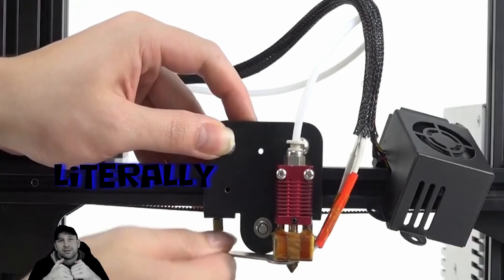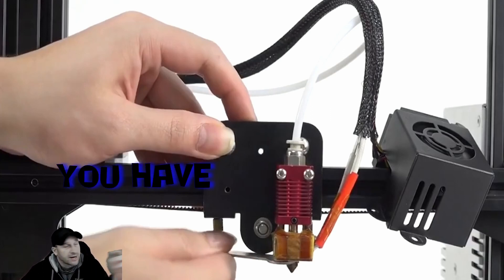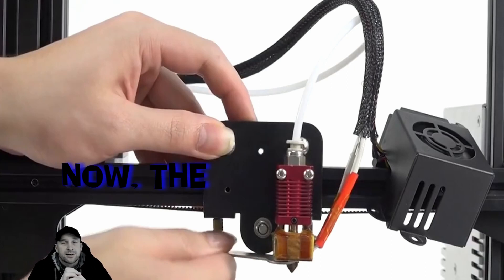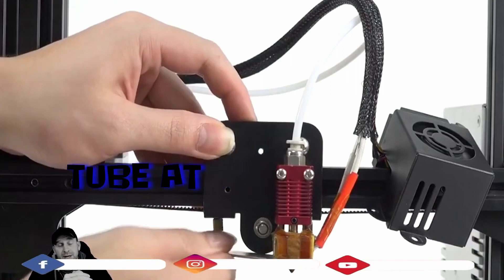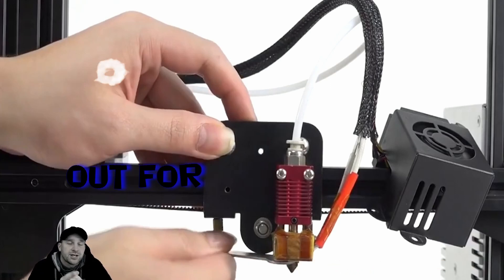The tube will literally flare out and start causing your filament to burrow up in there as well. Then you have to cut that filament tube — as you can see behind me — and feed in a new one. The good news is you can order higher-temp tubes. We recommend the blue tube, so go ahead and order that blue tube if this issue is a problem for you.